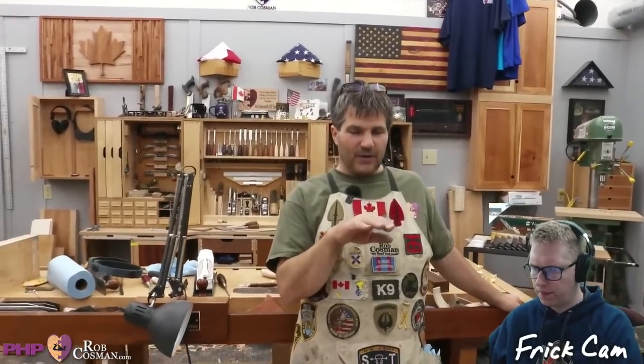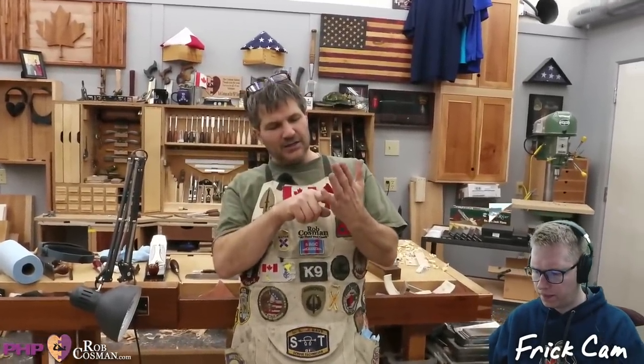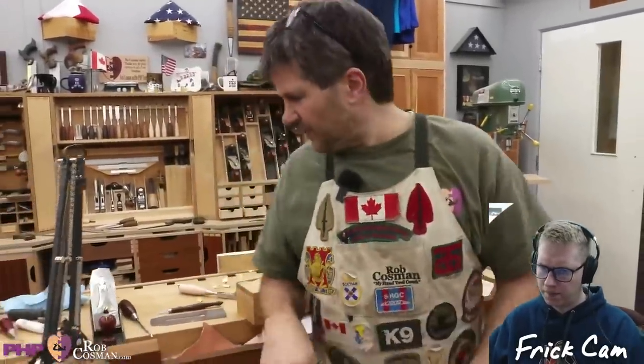And then I'm going to go over to my tertiary. Now I'm going to raise the blade up a little bit higher, and I'm going to polish, ideally, just the leading edge. And if you look at your blade, get some power on if you need, and you see dull, shiny, dull. So I'm looking at the bevel.